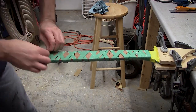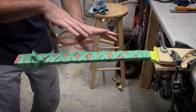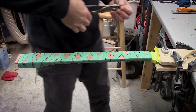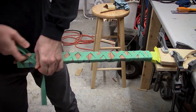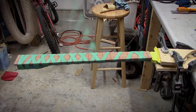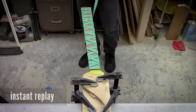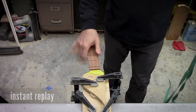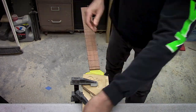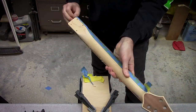And it took me right at 6 minutes from spreading the glue to finishing the hog tie of the rubber band to install the fingerboard on the neck. And I let it dry overnight because when I did this, it was pretty late. But it's a pretty quick process. And I think if I continue to practice it, it will go a little bit quicker. I'd imagine I can get a fingerboard installed, clamped on in about 5 minutes with no clamps.